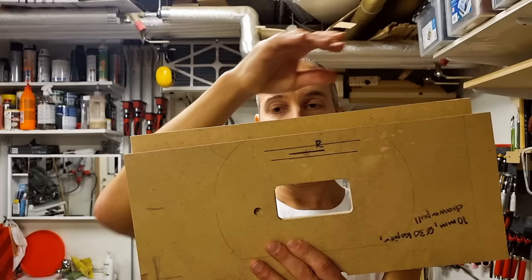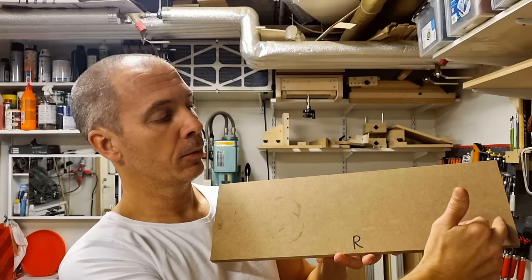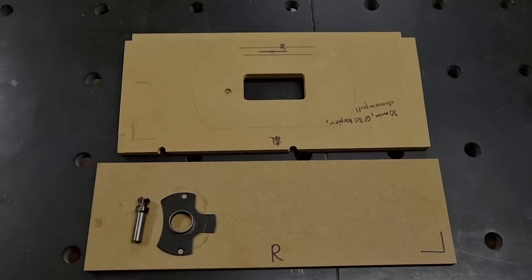For a draw pull grip template, we often get away with clamping around the outside of the template without any risk of interfering with the router. So in this case I'll use quite thin MDF — 12mm — prepared with one straightened reference edge and one square corner. We don't strictly need the square corner in this case, but it's a good habit to always have one.